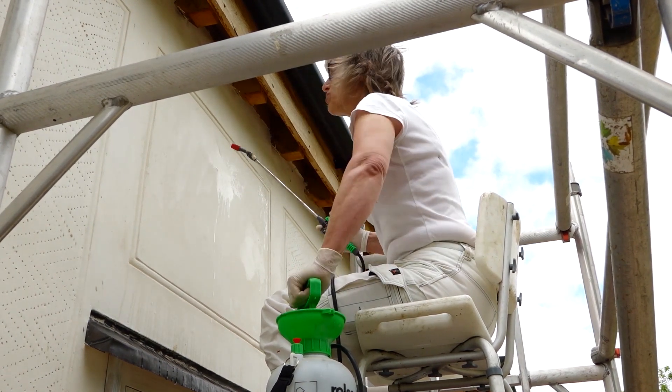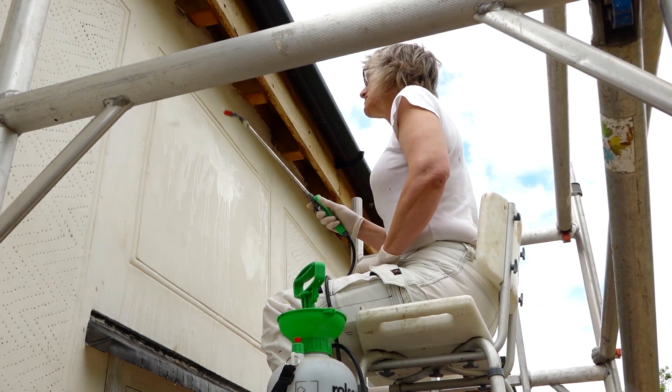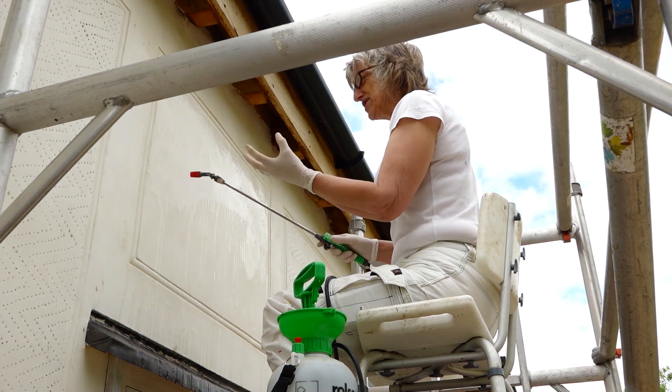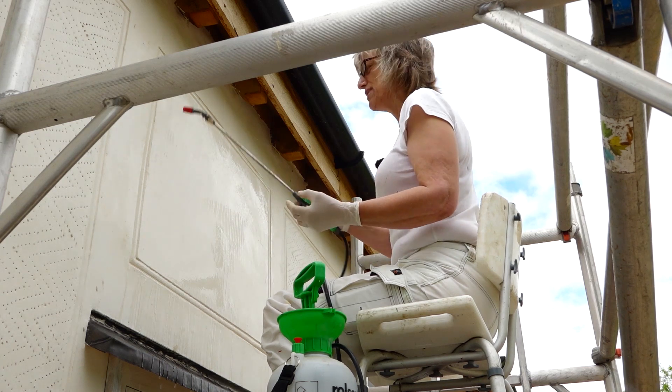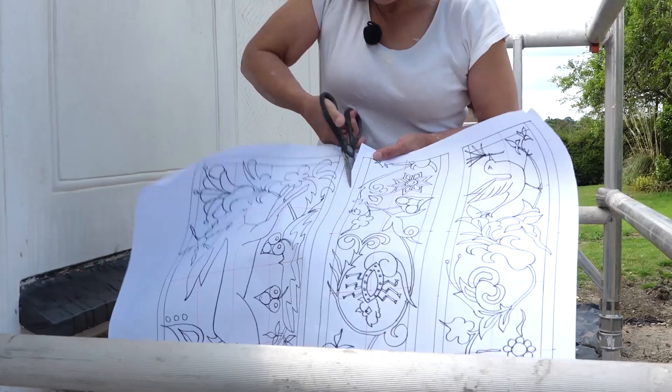Here I am making it damp, because it's well set. There's not much moisture in the background, and it will stop the plaster drying out and turning to dust before it gets a chance to set. This is July and it's warm, so it needs lots of spraying.